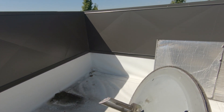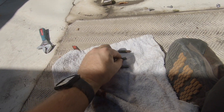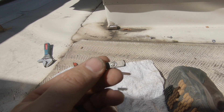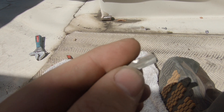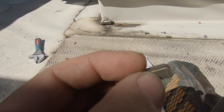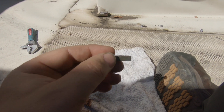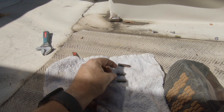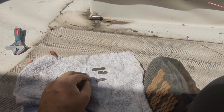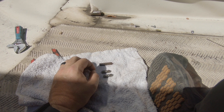Now we need to get the shaft off of here so we can get the keys out. We got all three of them out and cleaned them up. This is why you want to use new keys — when you put the set screw in, it makes a little dimple mark, so when you need to slide them out they get stuck. If you can always use new keys, do it. I couldn't find any in town, that's why we're reusing these — it adds a lot of extra time for something so small.